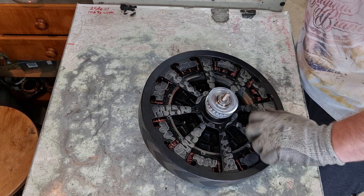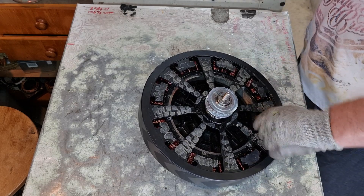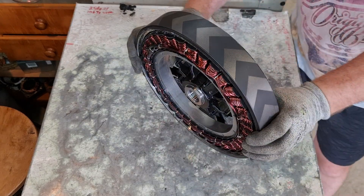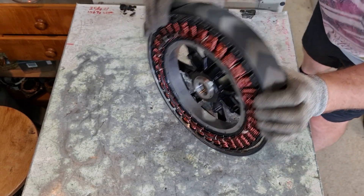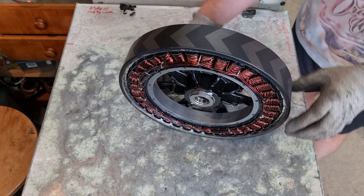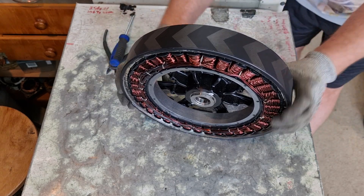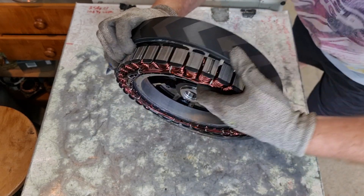What I did last time was press the stator out from this side, and had to jam a couple of things in there to keep it from snapping back. I almost had my fingers caught in here, so I'll try and use my thumbs to push it. As you can see it's kind of protruding out the top — what we need to do once it's out is pry it or keep it from sinking back in towards the magnets. These magnets are ridiculously powerful.